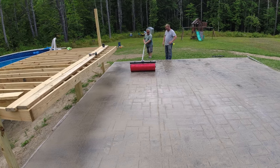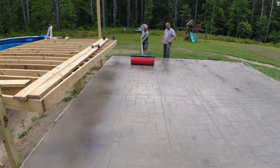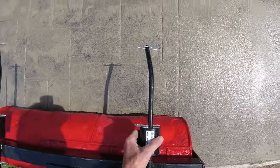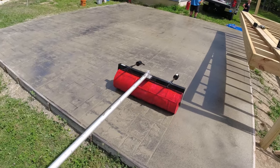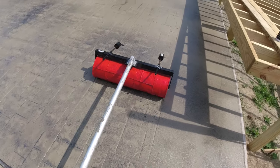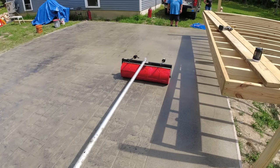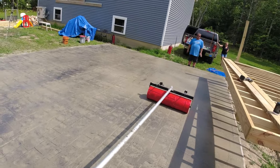You really need good access all the way around — it's not ideal if you only have one edge accessible with walls on the others. Right now I'm adding the weights that come with the roller. You can see those two little round nubs on top where the weights attach, and you can slide on more weight over those bars if you need it. We determined about this row that Luke needed a little extra weight — it wasn't leaving as good an impression as it did at the start. It had only been about 10 to 15 minutes but it was just so hot the concrete was drying like wildfire.